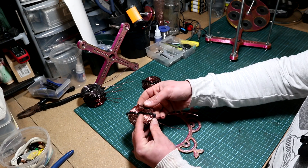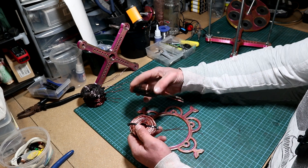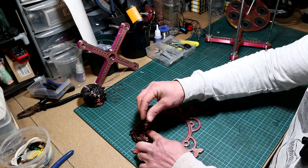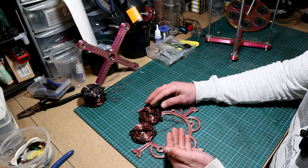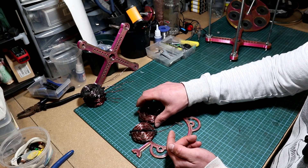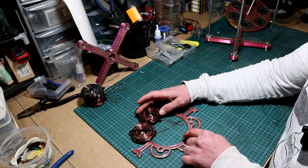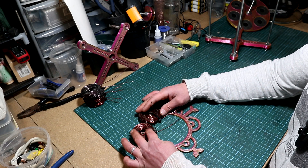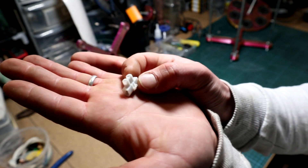One wire is coming all the way around and ending above, while the other — the beginning — starts from under the coil. The second coil has been wound in the same clockwise orientation, starting from beneath and ending on top. To configure the monophase, we take the first coil and the wire which is under — the beginning of the first coil — and connect it to the ending of the second coil, but the second coil has to be flipped.